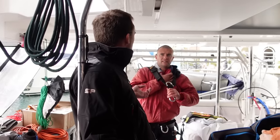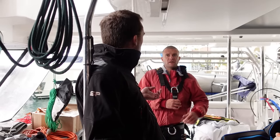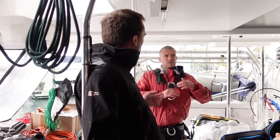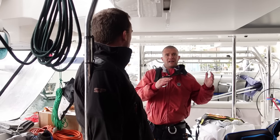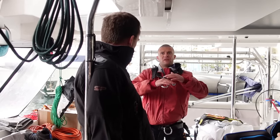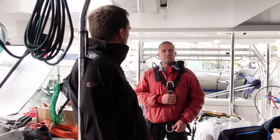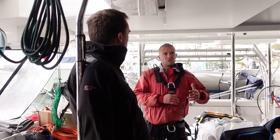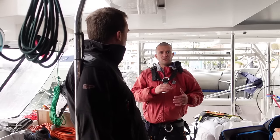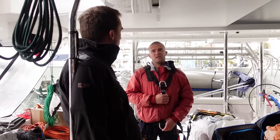So do you take them to full tension straight away? You can. For me, I prefer to put the full tension because the wire is new. And after a couple of navigations between 15 and 20 knots, in 3 or 4 hours, you lose about 200 or 300 kilos.